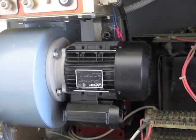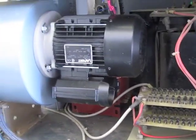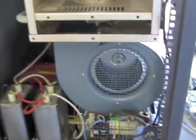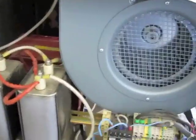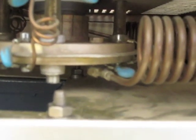There's the new blower motor. Got rid of the mouse too — he's gone. Isn't that a pretty blower motor? I think they paint those things when they rebuild them. There's the business end of the blower motor where it sucks the air in and blows it up into the cavity. I put the bottom plate back on the whole tube cavity area and did some dusting to get rid of a lot of the high voltage dust that accumulates. There's where the air really blows into the bottom of the tube socket, and then it goes past the tube socket to the next plate.